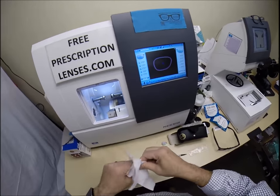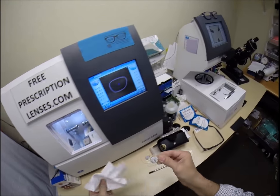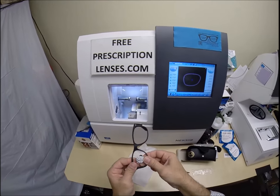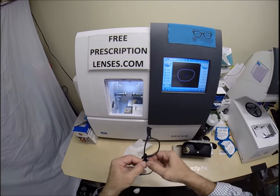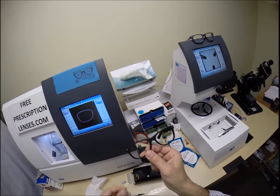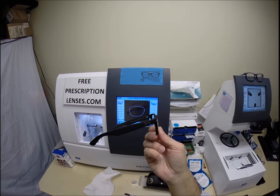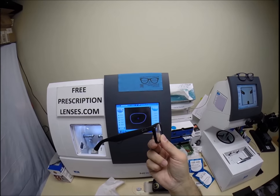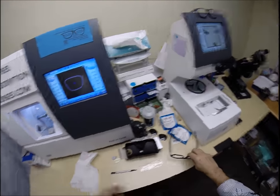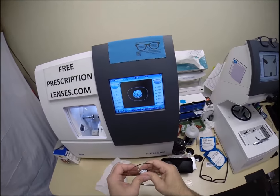I'm going to open up the chuck — thank you Charles, you're such a prince — and drive the lens off. I press it in; I'm a little skeptical this will fit. I'll tuck it in at the outside corner using my thumbs and it pressed right in. For non-prescription lenses the 55 New Wayfarer fits easily; for prescription lenses I usually have to take them down about half a millimeter to three quarters of a millimeter. I'm going to flip that over to L and take this lens down a tenth of a millimeter.